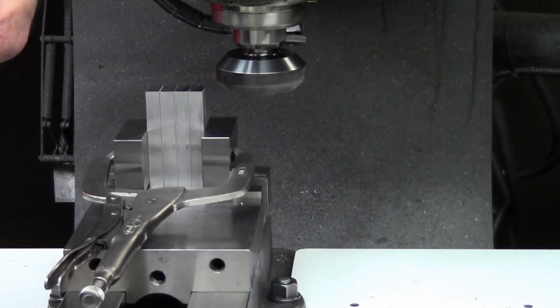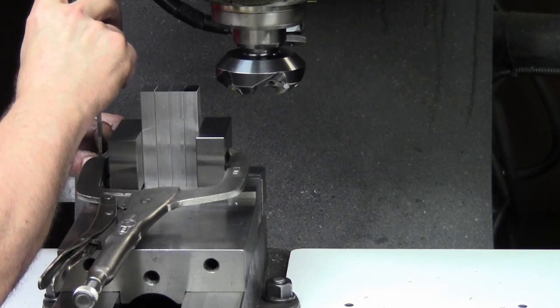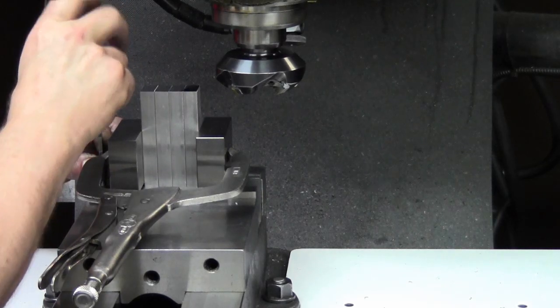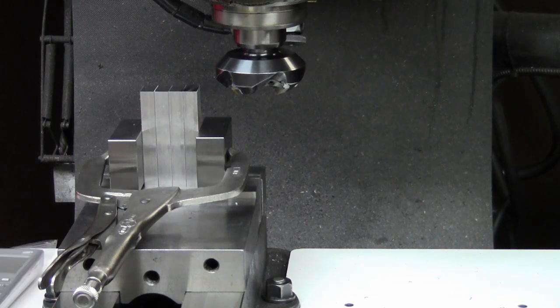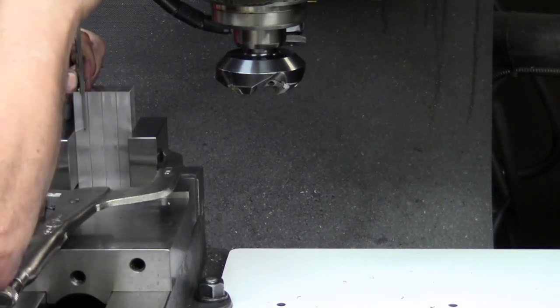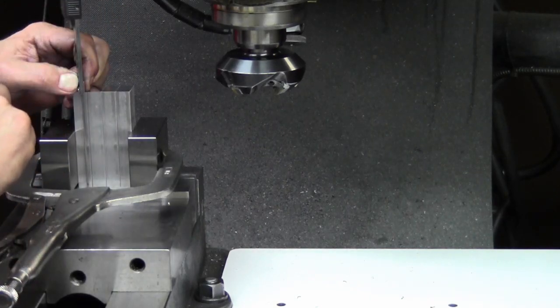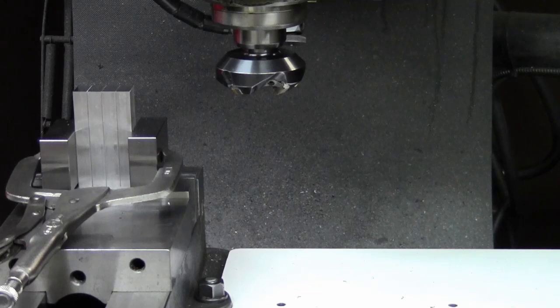inches long. I'm just going to measure with my calipers down to my parallel, 1.477. Grab a calculator. Hold on. 1.477. Enter. And then get over here where I can measure down to here. Like I said, this isn't critical, but 3.555 plus 5.032. So we got 32.5 to go. I'm going to take 30.